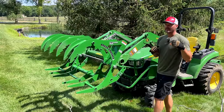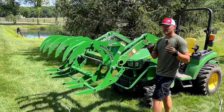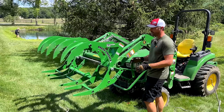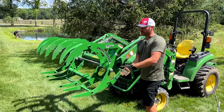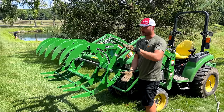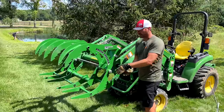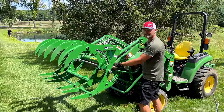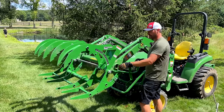There's been a couple random reviews on YouTube amongst all the good reviews. These random bad reviews seem to get all the attention, but I want to briefly explain why that happens. If you have significant clamping force and you're not paying attention to what's going on, and you're allowing the tractor cylinder to clamp as hard as it possibly can against that bottom jaw, you're going to create extra stress around the back of this plate here. And I believe that's what caused those problems for those couple of owners who posted those videos.